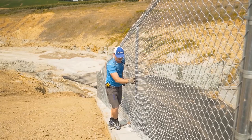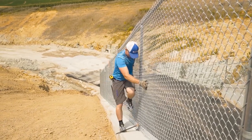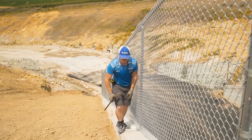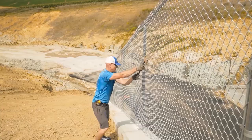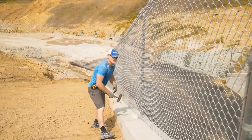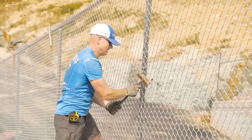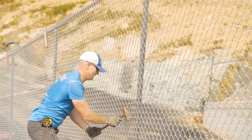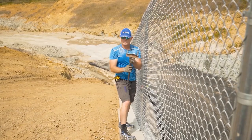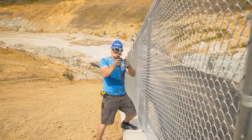Now how does it look? You can also take and rake it. The reason why that happens is the galvanizing coating that builds up in these intersections and gets stuck. They get crimps next to it so they don't slide very well. By raking it, you break those free and let it slip and get in line.